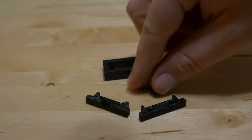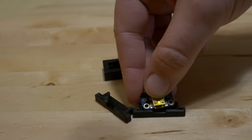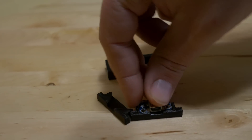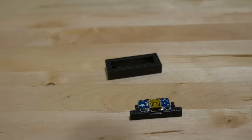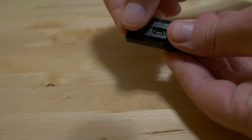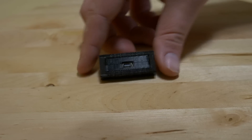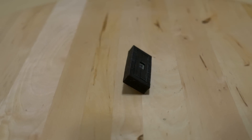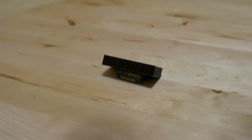Like the USB-C connector, the computer-side connector is made up of three parts: the bottom, the breakout board — this time using mini-B USB — and the top part. This breaks out the USB from the Pro Micro that I'll be using. The Pro Micro has just enough pins for all the keys in this keyboard, and it's only about three dollars on Amazon, as opposed to the Teensy which I think was around $13–$15 last time I bought one, so you save a bit of money.